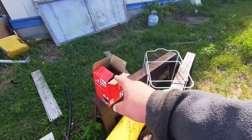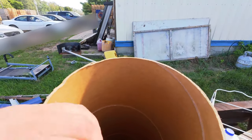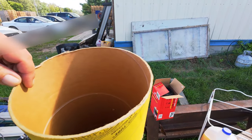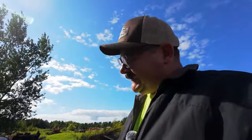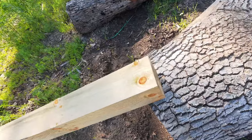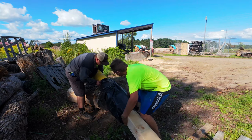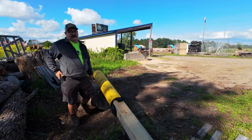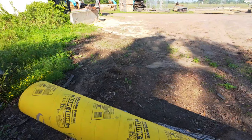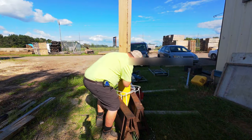First order of business: take one of those bags, wrap it on the post, then use the tube after it's wrapped and set it in. We'll fill the spaces on the outside of the bag with sand. It's important to round out the corners so they don't rip the bag. The tube is a little longer than the bag, so we need to cut it down — around three feet so it fits up to the bag with overlap. Now we're rocking and rolling.